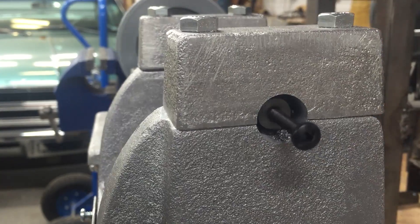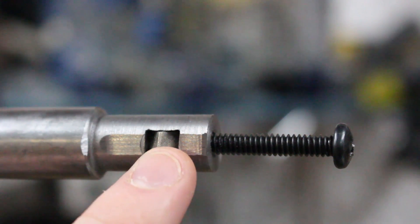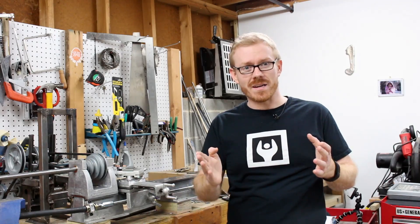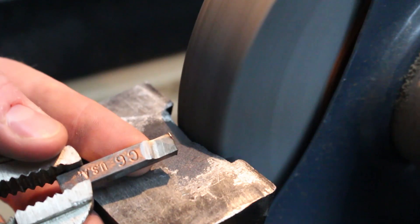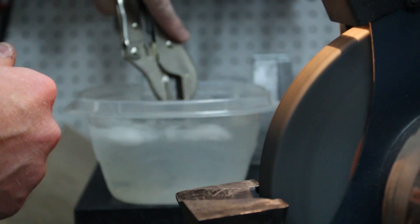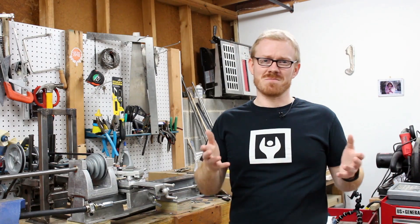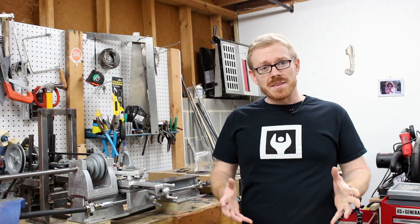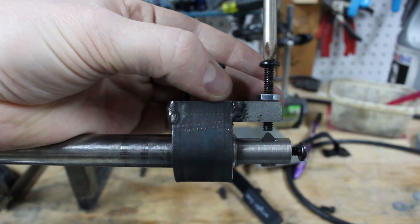During that initial cut I was getting a little bit of chatter. I chalked it up to the fact that the cutting face of the lathe bit is actually offset about an eighth of an inch in front of the center line of the boring bar, which results in essentially a negative rake to the cutting tip. That's not really desirable for aluminum, so I decided to try and grind my own tool bit. I used the offcut from the lathe tool and ground it down. Once I got that into the boring bar you can see that it's much closer to the center line. I was shooting for a little bit of positive rake. After I had the cutter ground to where I felt comfortable with it, I had to make a gauge adjustment tool for setting the depth of that cutter.